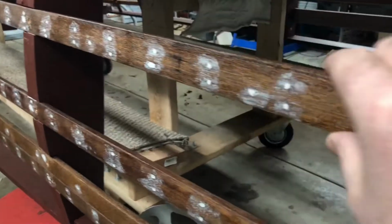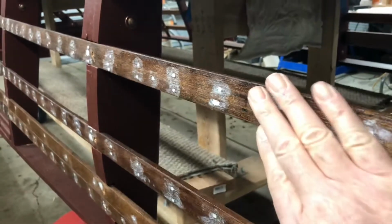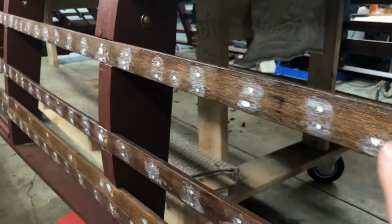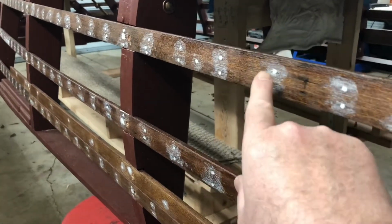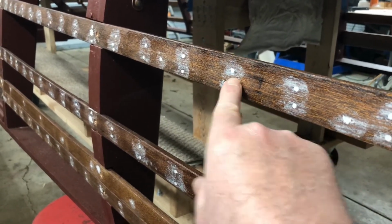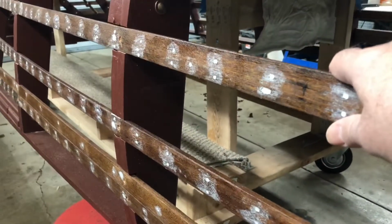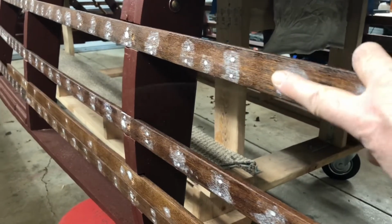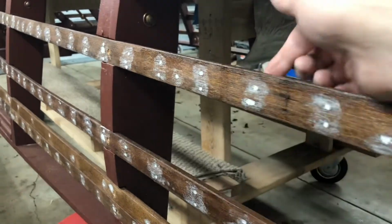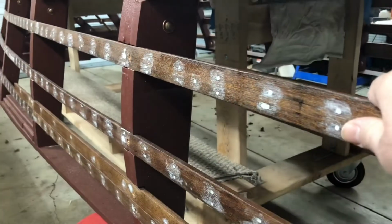So these are about 1 3/4 inch wide, a 1/2 inch thick. So what I did on these, all the old wood screw holes, first I lightly sanded all the wood. Then I drilled out all these old wood screw holes with a 1/16 inch drill to provide a little air passage. And then I filled everything with Smith's Fillet Epoxy sealer. So when I pushed that sealer in there, it was able to push all the air out and then come out the other side a little bit so that I know that these little void spaces are completely filled with the filler.